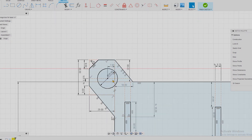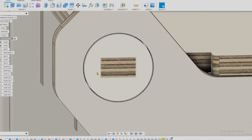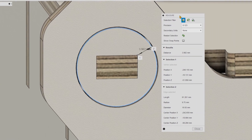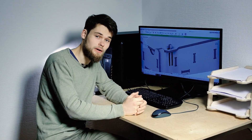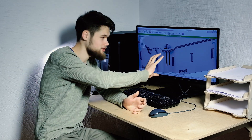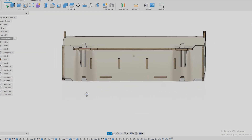When modeling the bearing mechanism for the lid I wasn't really sure how small I could make it. I was worried if it's too small it wouldn't last long, but on the other hand if it was too big the whole bearing area would look bulky and it would be more difficult to make the boxes stackable. Also I thought it would be great to have clip tenon joints that would hold the lid closed even if the box was upside down. Soon I had the components ready for CNC cutting.